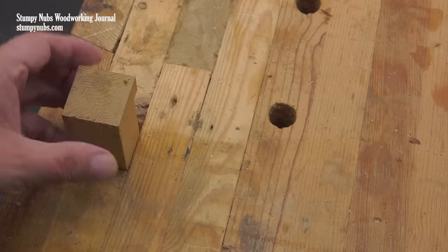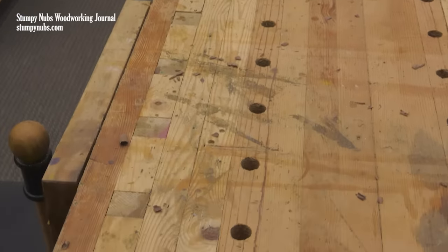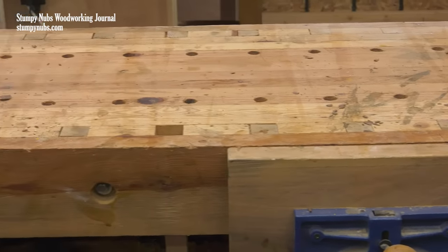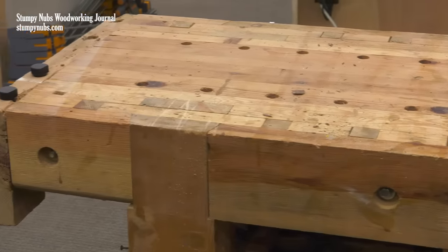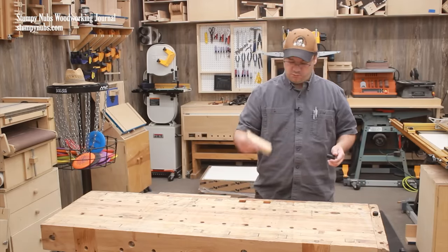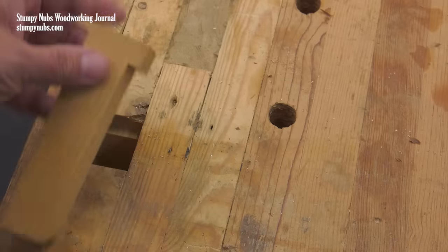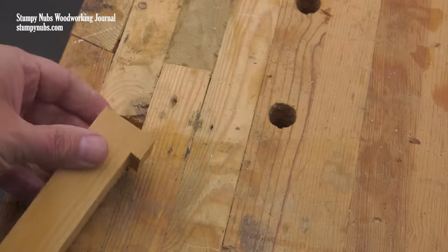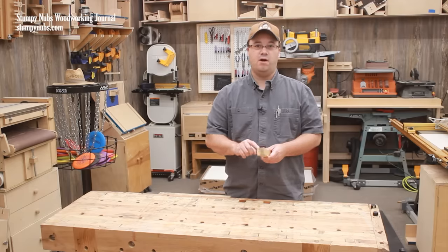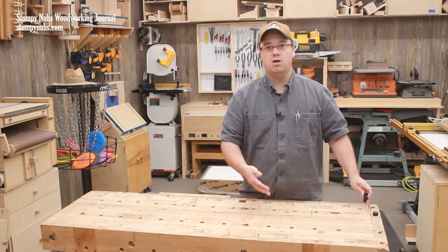One feature I go back and forth on are these square bench dogs. All the mortises for these were made during the layering process, so they didn't have to be chopped out or bored out individually — that wasn't a big deal at all. But some people ask when they use my project plans why I have two rows of square holes for square dogs and two rows of round holes for the holdfasts, when they can just use round dogs in the holdfast holes and eliminate the rows of square holes. The answer is I like square dogs — they just have more of a traditional feel. These all have little lips near the top that catch on notches in the hole to keep them from falling beneath the bench. You push them up and spin them around and that same notch holds them above the bench. Functionally, round dogs work just fine, so there's no reason you couldn't eliminate the square dogs if you wanted to.